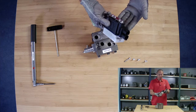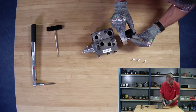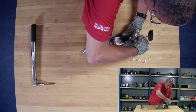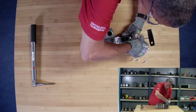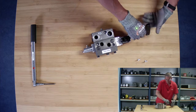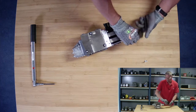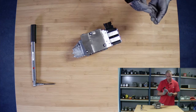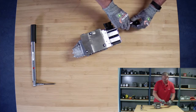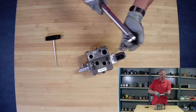I will now install this PVE again. We take one screw, and we need to make sure we are in the right position because of the LVDT. Like this, and then we can put it up on the side again to get the two bottom screws in. You can also feel how, when you tighten the screws, how everything sort of tightens up and everything is good. In the end, you need to torque these screws down with the correct torque, which you'll find in the service manual.